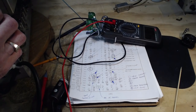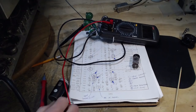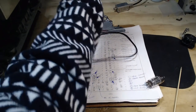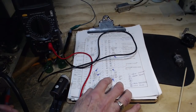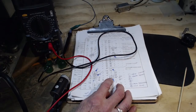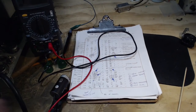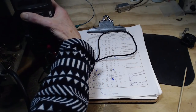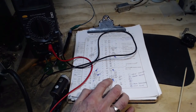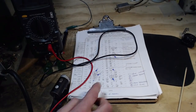Okay, V16. Double checking that. V16 and V46, where we get infinity. On 16. I think I'm just repeating something I just did, but that's how it's going to be. 7, 8, 9, 6. It's supposed to be 46, and it's open. Open circuit. Yeah. So we still got this one to deal with.